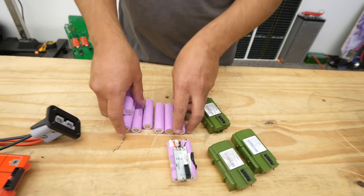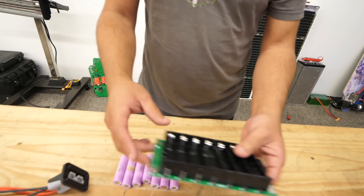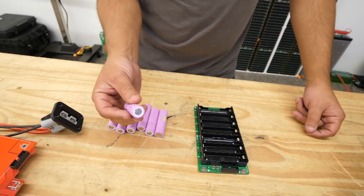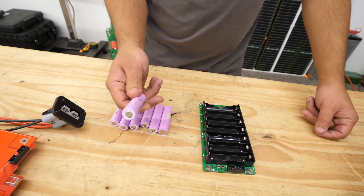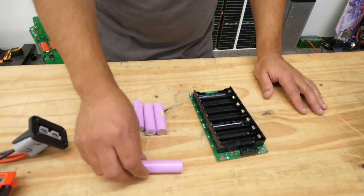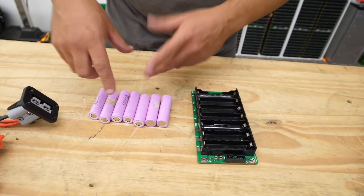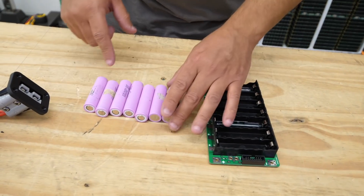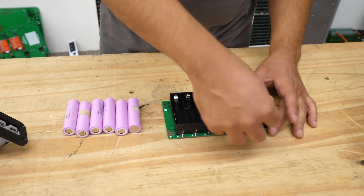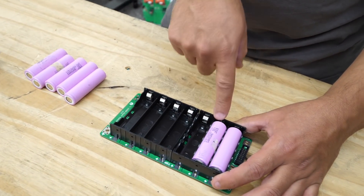What you can do is load them up into your 25-cell PCB boards. I suggest that you test these — put them in a charger and cycle them through a couple of cycles. Then you can write down the capacity and internal resistance and match them, so you put some that are not super degraded together with some that are really good, as closely matched as you can. Then you load up your board, paying attention to positive to positive, negative to negative.